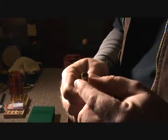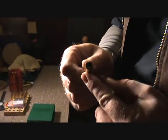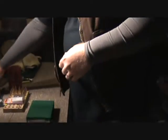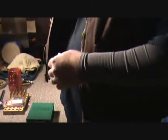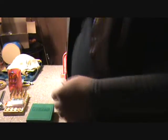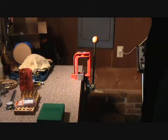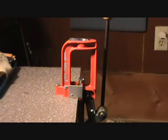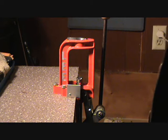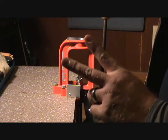That's the whole reason why the military actually crimps these in — so that the primer will not come out of the pocket and get into the mechanical firearm, machine gun, whatever the military uses. Now most of your commercial brass does not have the primer pocket that is crimped, where this Lake City brass does.